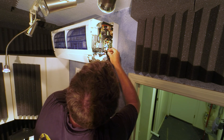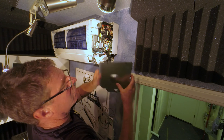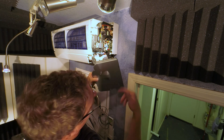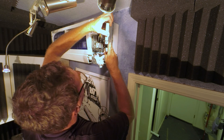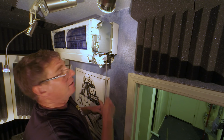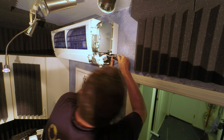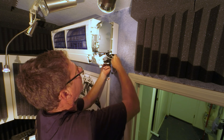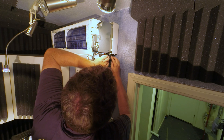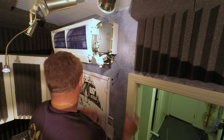Now you have to route the wire out of here. Looking at the way the new board is laid out, there's really no place to route it, but luckily they added all these cool little wire holders for us. We can stick it up in here like this, run it down through here and out this bottom piece, because the new covers are metal and plastic. Route it out the bottom right there. For the next part — routing the wire out to the receiver — the easy way is to just put it right on top of your line set and route the wire appropriately out of the way to wherever you want to put your receiver.